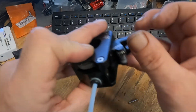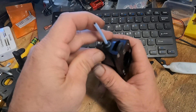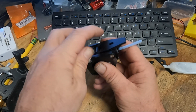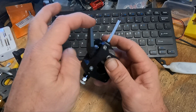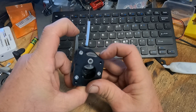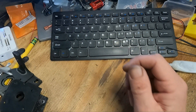No wobble on that at all — obviously there had to be some wobble with the 7/64ths shaft. It's a little concerning because maybe they wanted a slight wobble. But oh yeah — now when I turn this, that's what we want. What was happening is the hole for the shaft was wallowed out, it wasn't letting it go in as far as it should, which was requiring the lever to be pushed down more than what this was really designed for. I'm happy with that — that's a good fix. I have one with a plastic extruder on it; I'll go ahead and swap this out with that one.